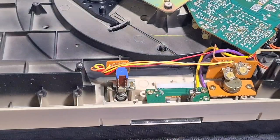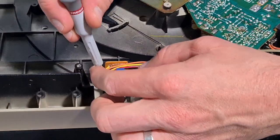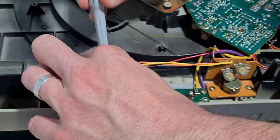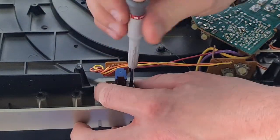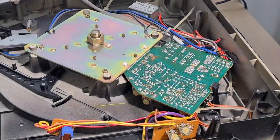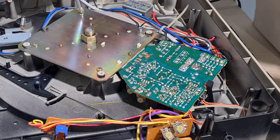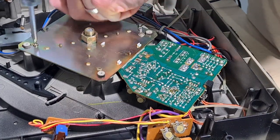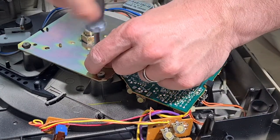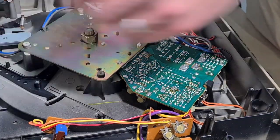After a quick review of the service manual, I'm going to get a smaller screwdriver and remove the play switch, which is two smaller screws - don't lose those. This should give us a little bit of freedom, because this motor board and the motor itself all comes out in one go - it comes over and flips off like that. So we'll remove these four screws, and with some cutting of these cable ties we should be able to remove the motor completely - don't forget this one is an earth point.